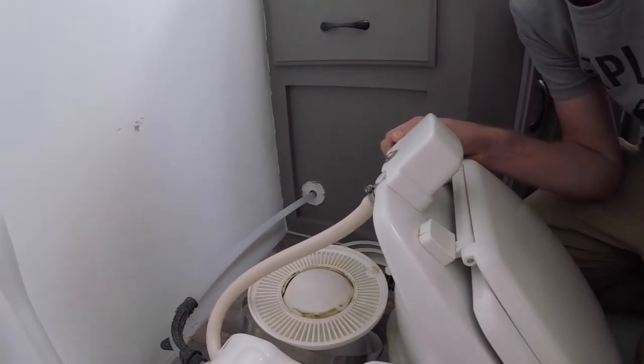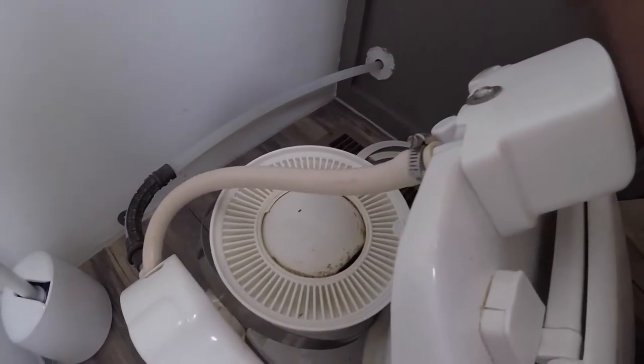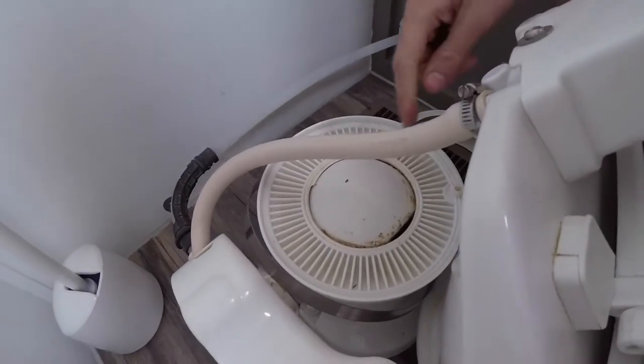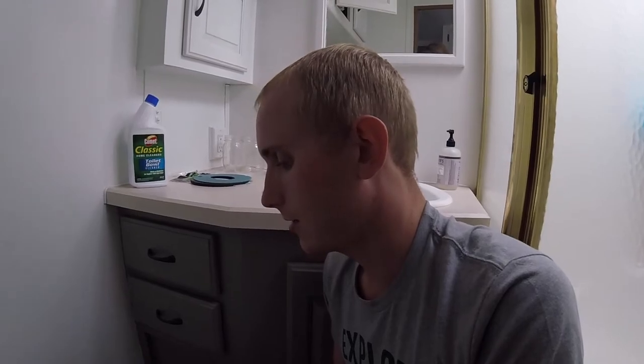This is pretty gross. We didn't know this previously, but we saw in our manual that our toilet actually came with something that almost looks like a toothbrush — a really skinny handle. It's meant to slide between the seal, this rubber ring, and the actual ball. When you clean the toilet, you're supposed to shove it in this crack around it and scrub, and that prevents this corrosion from happening. We had no idea it existed — it was actually taped to the bottom of the bowl and had never been used. So this is like 12 years of gunk buildup, though it's really not that bad. That's something to make part of your routine toilet maintenance: find a skinny scrub brush you can squeeze between the ball and the seal and just keep that clean.